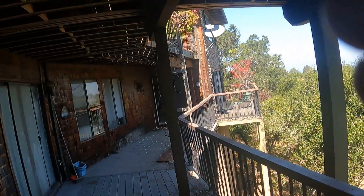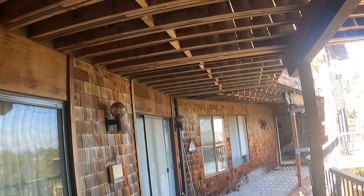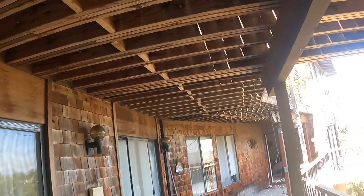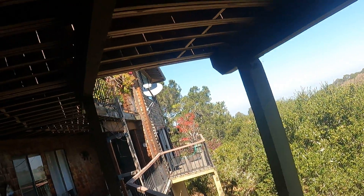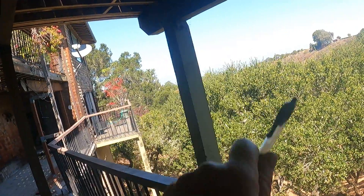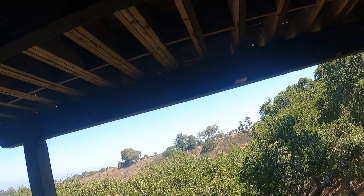This used to be a cantilever deck, and what they did is they cut out where they needed to — the original joist. You can see there's only about 2, 2.5 feet here. And then they sistered up and sandwiched in. It's sitting on this first beam and that second beam, except nothing is tied down to the beam here.